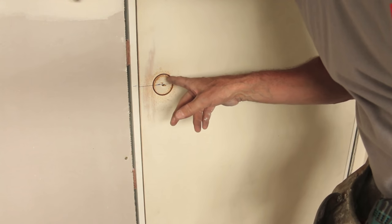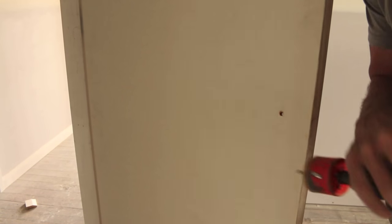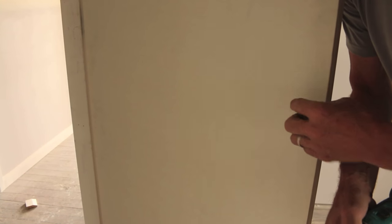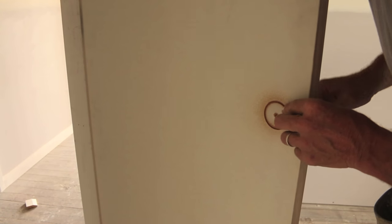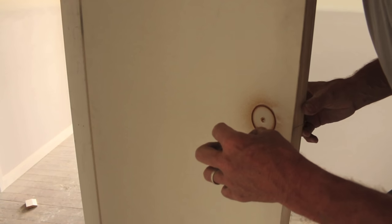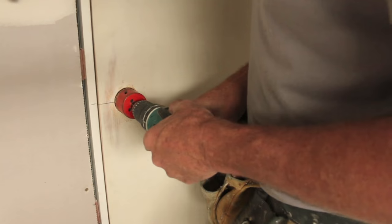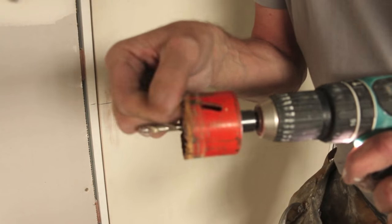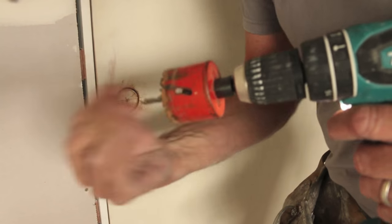I don't like to drill all the way through first. If we come around here, you'll see that the drill's pilot hole bit has come through the other side. I'll attack the door from this face right now. That way, when I come back again from the other side and the drill comes through, it's not going to puncture out and splinter any of that veneer. Back around the front — now I'm going to drill the hole in the front. Sometimes you might need to clean out the hole saw, it gets a bit clogged up sometimes. And then back into it.